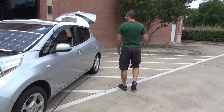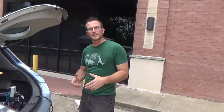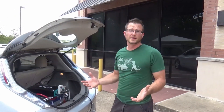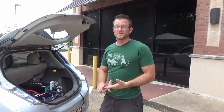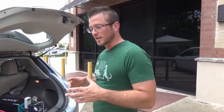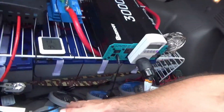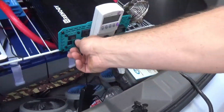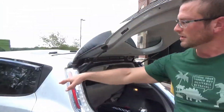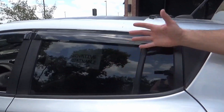Normally I only have this thing running for about 15 minutes every hour, and that balances out the charge coming in and going out and gives all the electronics a chance to cool down for 45 minutes an hour. Since we're going to be running this straight for 90 minutes — because that video camera doesn't have a 12-hour battery — thermal regulation is going to become an issue almost immediately. So I've hooked some little USB fans into the USB port on the inverter to help keep it cool, I'm going to crack the windows, and I've got some tin on the back and these visors so at work I can leave it cracked and rain won't get inside.